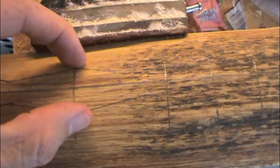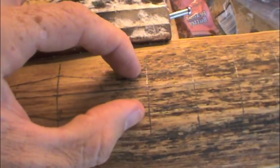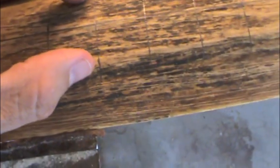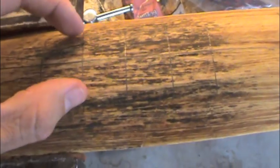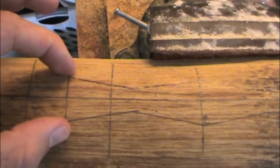That'll be the center of the handle. And then I went 1 3/4 into a 1/2 inch, and then I came back out another 1 1/4 later to begin the fade. So the width of the fades is 1 inch on this bow on both ends here.